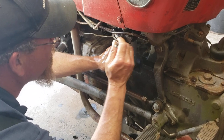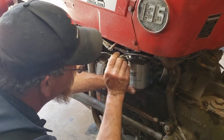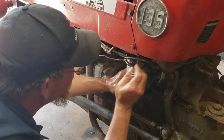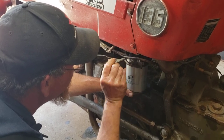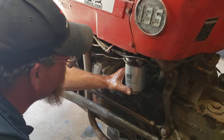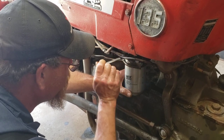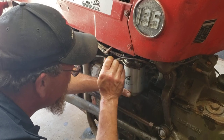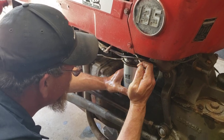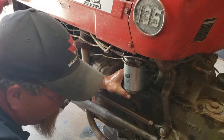These are quite possibly the most annoying thing in the world to bleed out with this kind of fuel filter. Make sure all your gaskets are lined up. Now if it has a glass bowl on it, it's easy to over-tighten and bust the bowl, so keep that in mind. You can always go back and snug it up a little more — better than going to town to get a new fuel bowl. If you're getting scared, just stop. Look at it real good; if the O-rings are lined up, you can snug it up a little more.